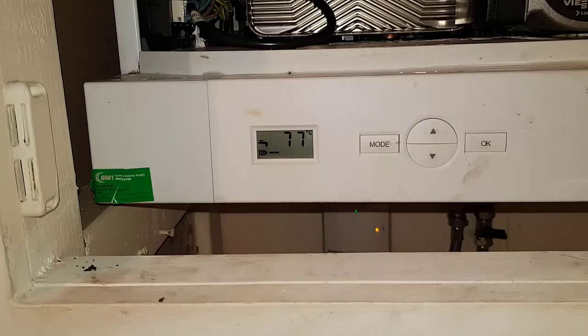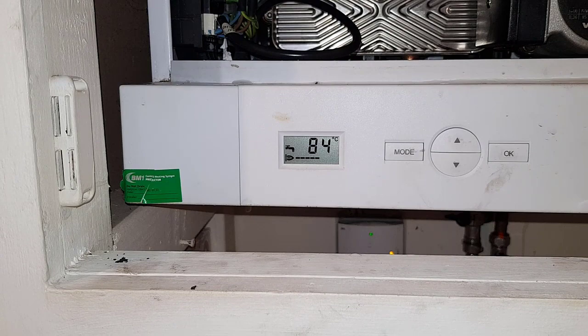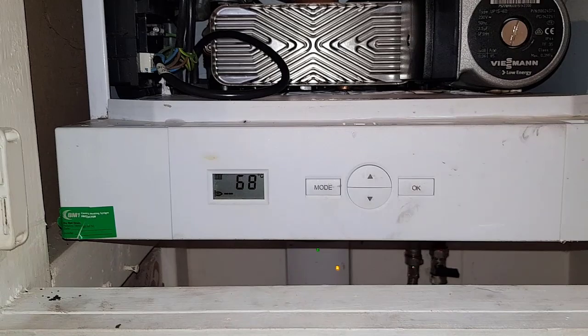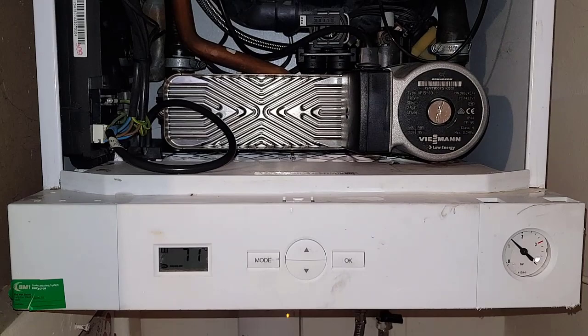Just testing the hot water again to see if there's any improvement. We are getting a partial blockage — looks like more on the plate heat exchanger rather than the main heat exchanger. So the end conclusion is the plate heat exchanger has a partial blockage. The main heat exchanger I think is working a lot better than I thought. It's going to need a new plate heat exchanger and a new expansion vessel since that was leaking from the Schrader valve earlier. But the pump's going round fine. So that's where we're going to leave it — see you in the next one, bye for now.